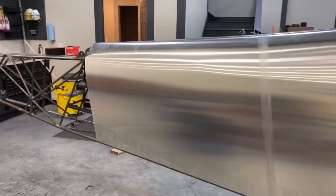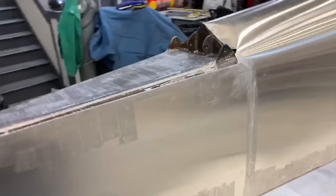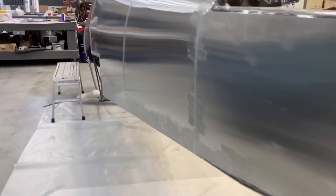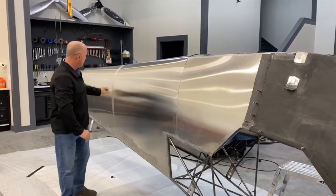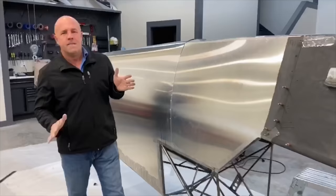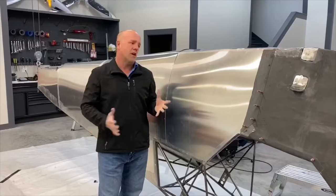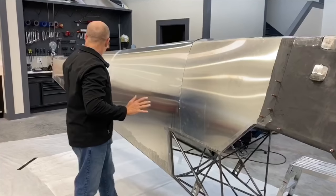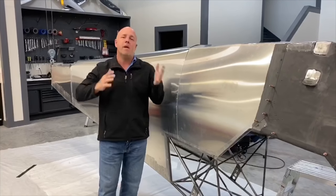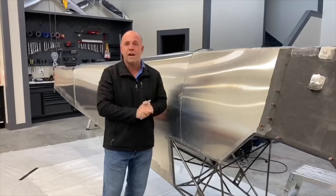As the start of the next day - it took all day and into the night last night to wrap this entire plane. A lot of it just held on with tape; a few places where the metal wasn't quite shaping the way I needed it, I had to put a couple pop rivets. This is so close I could just lay up carbon on it, but then there'd be little steps between each layer. You can see it's the 0.035 step here. If I were to just lay carbon fiber over that, then when I go to do body work I'd have to use a micro filler to bridge that 0.035 across to get a perfect skin - and that adds weight. So I'm going to do all my body work on here using cheap conventional bondo to shape a couple places that aren't blending exactly the way I want.